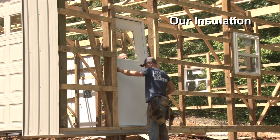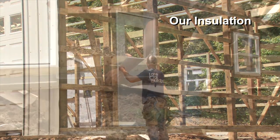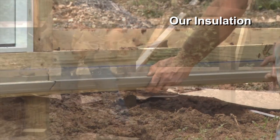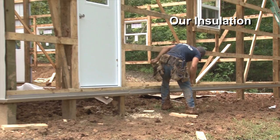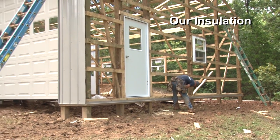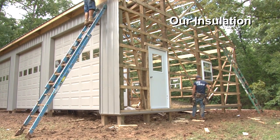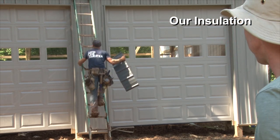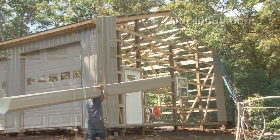Typically, we're going to use a bubble wrap insulation on a pole barn building — usually a double bubble, which is actually two pieces of bubble wrap. Heavier material, but it looks the same as packing bubbles. This is typically single-sided, meaning aluminized on one side, and what you'd see from the interior would be a white poly vinyl — a nice, clean, bright look. It's washable, rip and tear resistant, waterproof, and the bugs don't eat it. It's not going to wick moisture like fiberglass will.